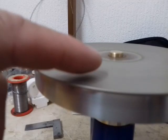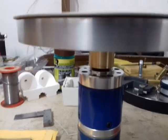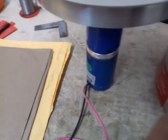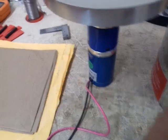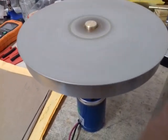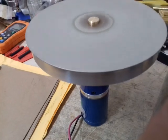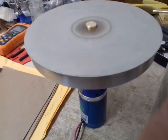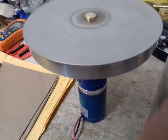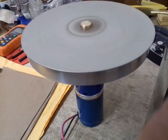So that would be a slow sharpening machine using the same kind of motor. If I wanted to get an uber fine edge — something with a very thin cutting edge — I can just turn that down. When it's on its maximum voltage it's at 215 revolutions per minute. I can turn it right down to 5 volts and go at only maybe 10 revolutions a minute. At that much slower speed the gearbox is a lot quieter on that one.